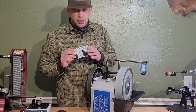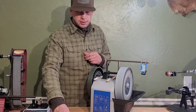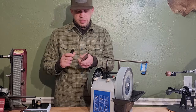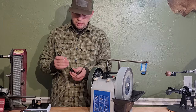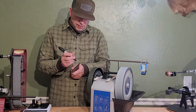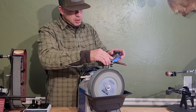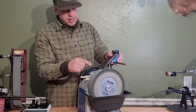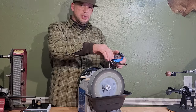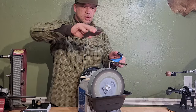So I think we're running about a 45 degree angle on this axe head — we were matching the previous angle. And the way that we did that is we used a Sharpie to paint it up, so we'll redo it right now. So now as we set this down on here, we're going to want to shift it, because this is at a radius — I like to radius it instead of going straight across.